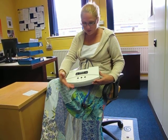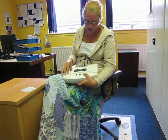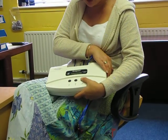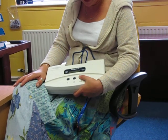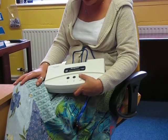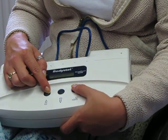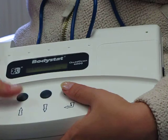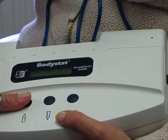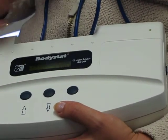If you have done a test earlier in the day and want to scroll back and check the data in the device, you can recall data by pressing the enter key and keeping your finger down on that while switching the device on. It then says 'recall data' and you select which test number. If you select number 7 on the screen and press enter, you can scroll back and see your test results — phase angle, resistance, reactance, impedance — and all the results will appear on there.